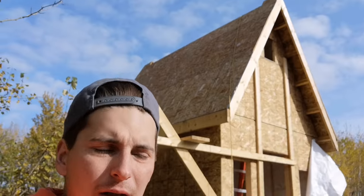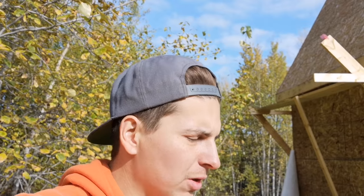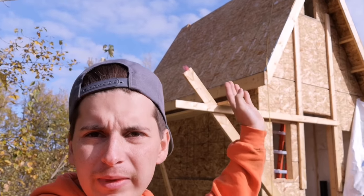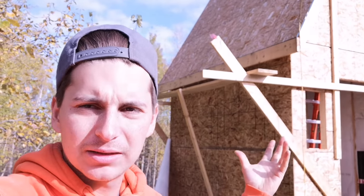All right, so here's the thing. When you don't know how you're going to do something because it's big or difficult or awkward, such as this roof, this is how I do it: you start with the one thing that you know you can do. So I know I can put the underlay on there. This material actually doesn't require an underlay, but just in case I want to put one, you can put one. You can put it over anything apparently, including just the raw sheeting.